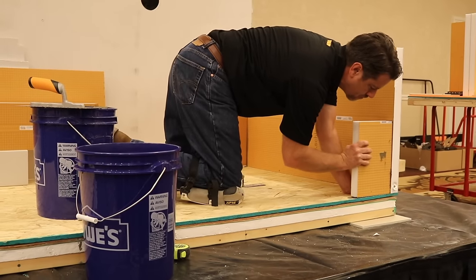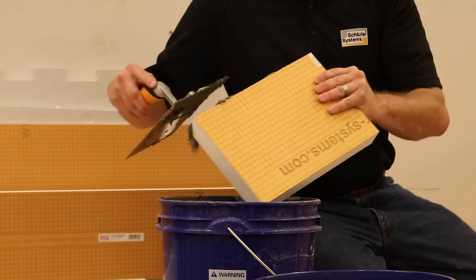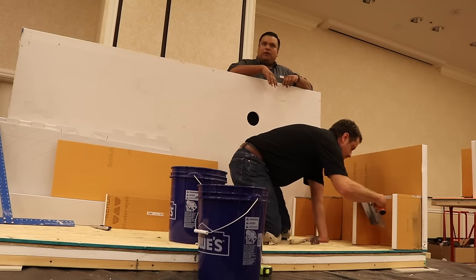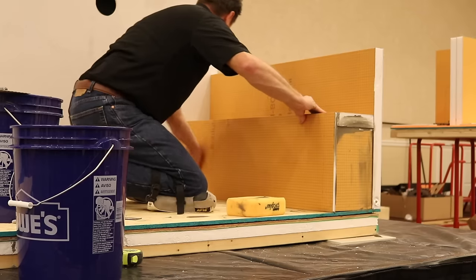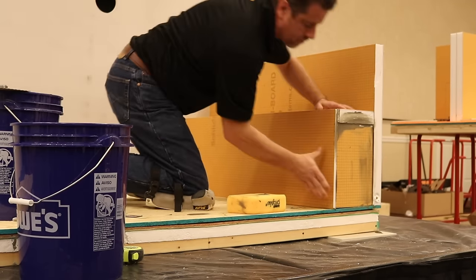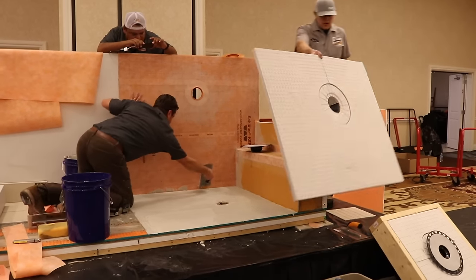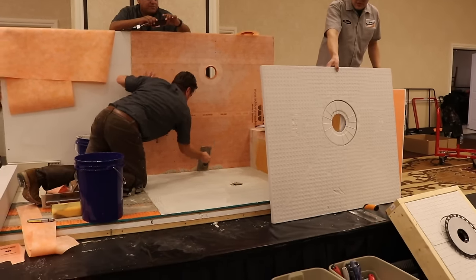So now I've got uncoupling, a lightweight material that's easy on the installer, thinness so I can flush everything out without big fat T-transition strips between tile and wood floor areas, and I can fully waterproof this. This is a really impressive system — I've really enjoyed the two-day training. If you're interested in coming to one of these events, I'll put a link in the description — I think it's schluterevents.com. Whether you're a builder, remodeler, architect, or tile installer, I brought my own tile installer and I've got two or three more I'm going to get to future events. They do about 30 events a year.